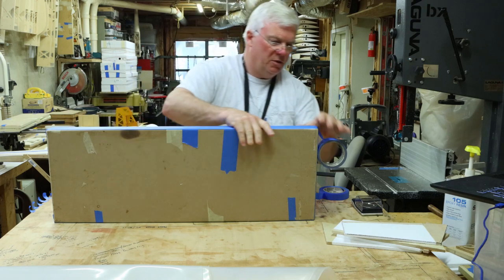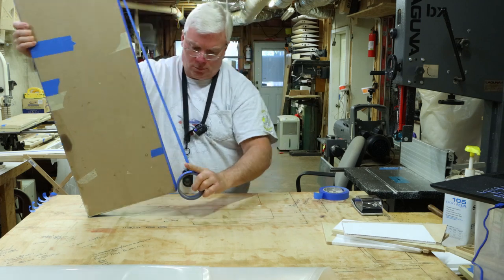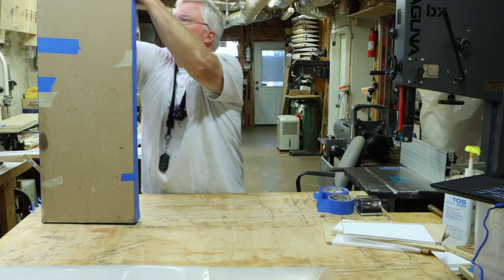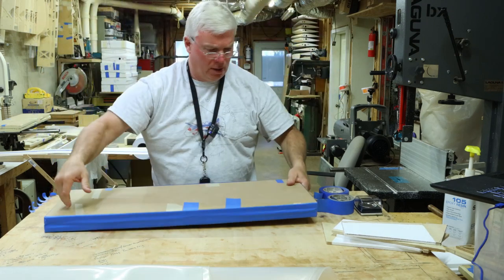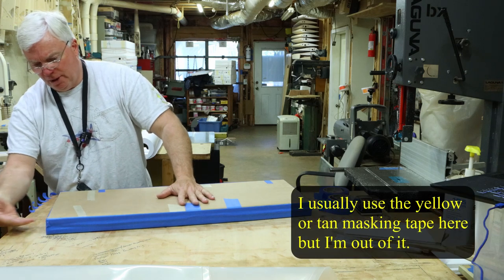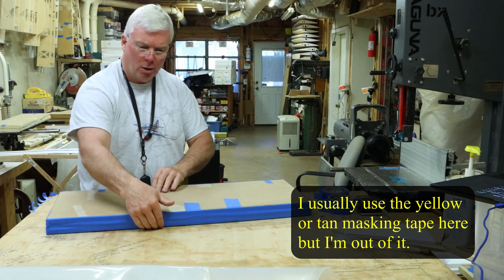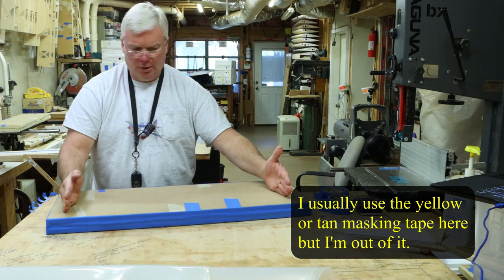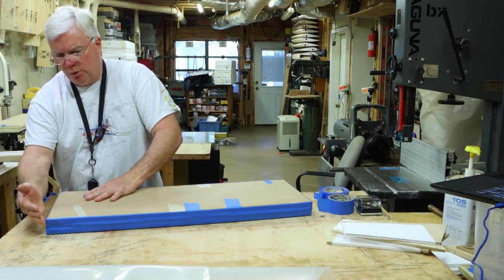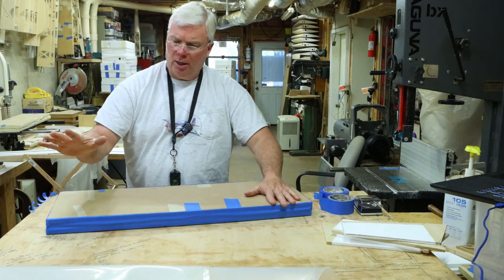And we'll put 2 rounds of tape all the way around, and that will protect the bag. And the reason we put those rounds of tape is, one, to keep the bag from being pulled into this gap on the end. It won't pull in here because obviously the part is blocking it, but our parts are only about this long, so that leaves that amount of gap that the bag could get pulled in and stretch the bag just a little bit, and that's not a good thing.